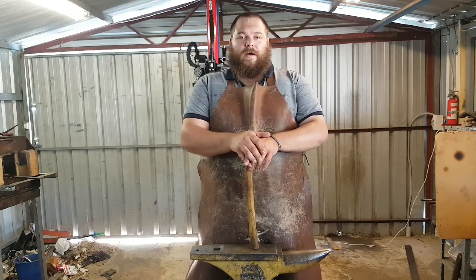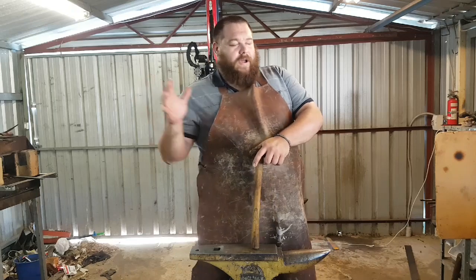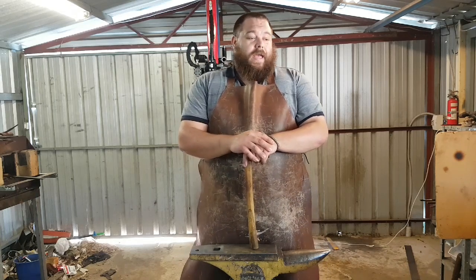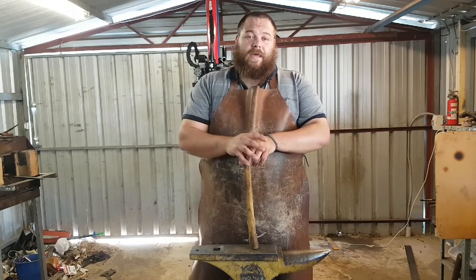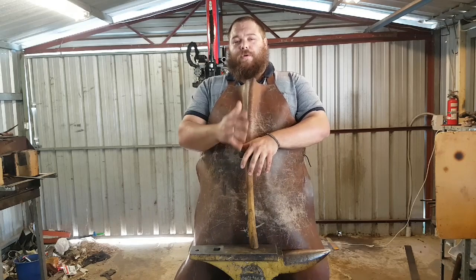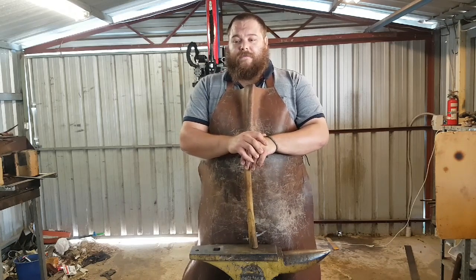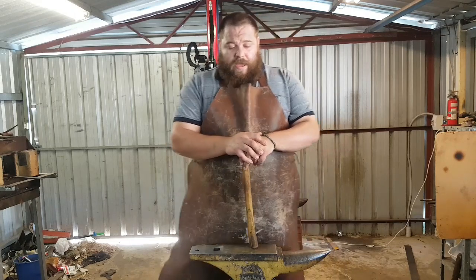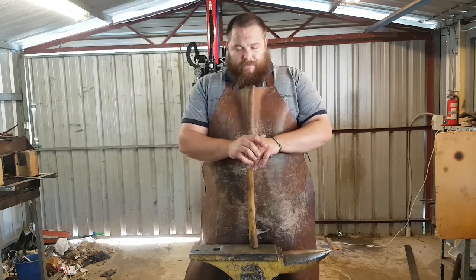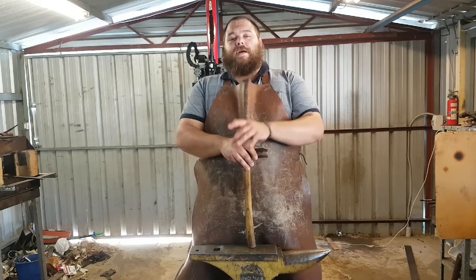Ilya, in his video, covered the formation of bevels by compression. When forging the bevels, you're trying to strike into the surface of the work to drive the material back into itself, rather than drawing or pinching the material out to create a bevel. He did cover the fact that that is primarily for traditional steels, for bloomery steels, for wrought iron and stuff like that, where there is an almost wood grain-like pattern due to the repeated folding, forge welding, and various inclusions. So he did state that that is primarily for his work with traditional steels, but modern steels do not have that issue — they don't need to be forged by compression.